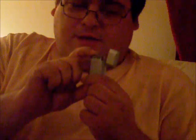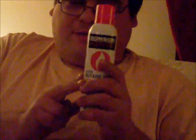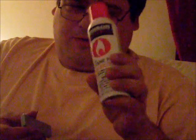You can put a lot of heat into a heavy wire with this and get solder to melt. But what I found is at Walmart in the checkout lane for $3.97, there's something called a jet light by Ronson. It is a little mini butane torch — you can refill it on the back. I soldered about half of my connections with this and half with the butane torch and they both did an equally good job. Your thumb can get a little tired holding it down after a while, but not too bad and cheap. I bought a can of the fuel at Walgreens for around $4.00, and I have refilled and refilled both torches and it's not even close to being empty.